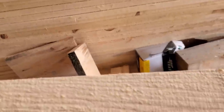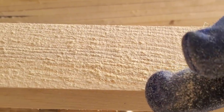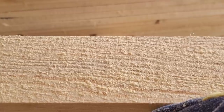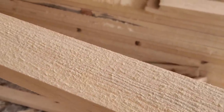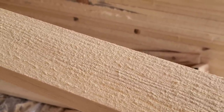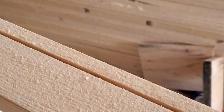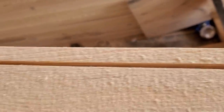So I think what I'm going to do is bend a piece of coil stock that comes down the wall over the top of this and maybe put a little kick on the outer edge just so that the water kicks back a hair more. And that'll give me a little protection so this piece of wood doesn't rot out in 5 years. But yeah, as simple as that, a little drip cap for the break in the siding on those gables.